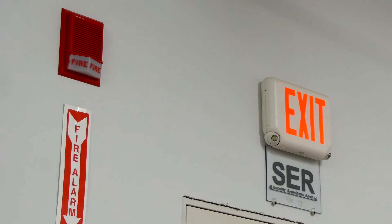This right here is the vintage Edwards 895B-201. These alarms were mainly installed in the 80s, and they're very uncommon to see in buildings today. I love the vintage look of this alarm, but with the panel's FWR output, the sound that this alarm produces is not the best — it actually sounds like garbage. But hey, it makes noise and it flashes, so it gets the job done.